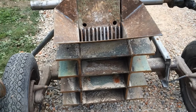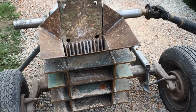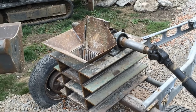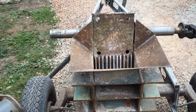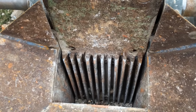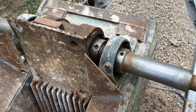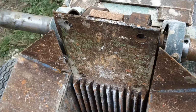It's out on a little trailer that's made from an old caravan trailer, with a couple of induction units, all hooked up. Fred Dibnah would have loved it. But yeah, it's a bit of a work in progress, needs some counterweights. I'm going to redo this whole central jaw plate and toggle plate. I've got about, I think, 8mm offset on the crankshaft, so it's probably a total of about 16mm movement up and down on the top.